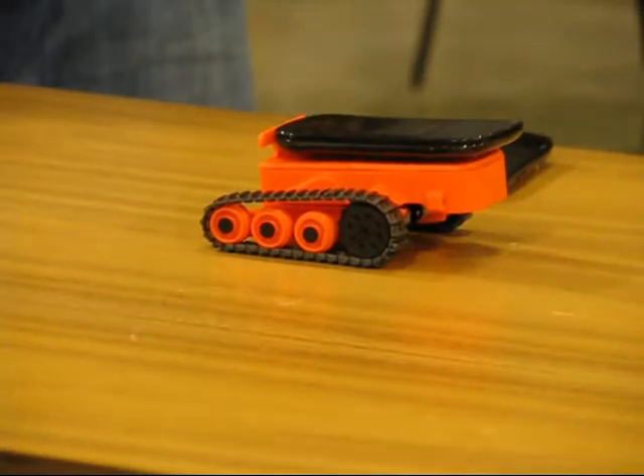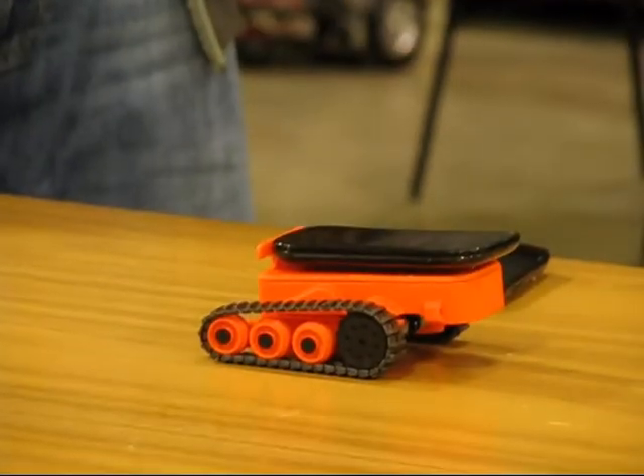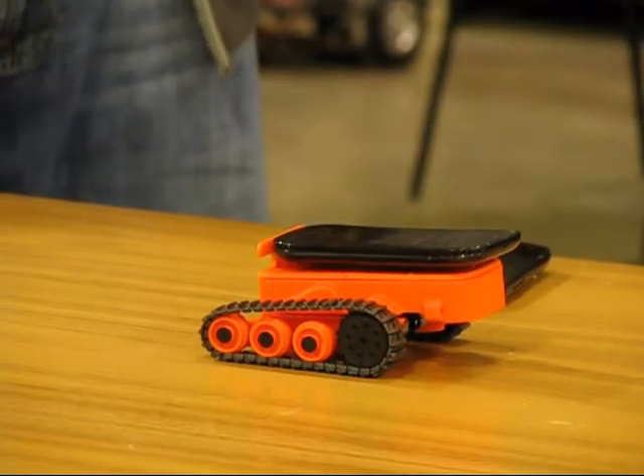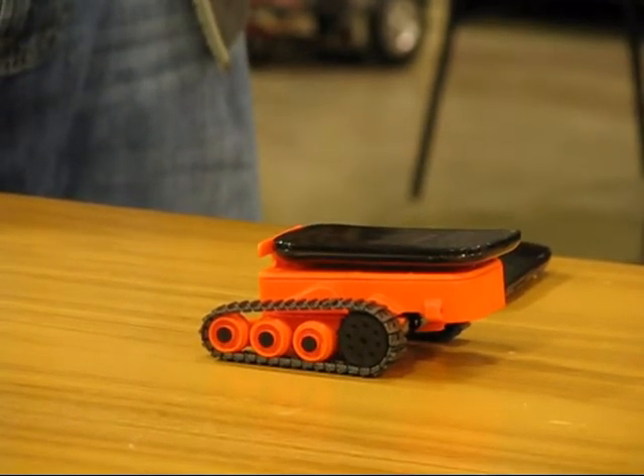You spend your money and it comes and you start printing. You don't have to assemble it like the original one — the original one was a kit. This one shows up in a box and you can conceivably start printing right away, although it doesn't really actually work out that way. You spend your first two or three days going through a list of tweaks you found online that you should make to it. Then eventually it comes to a point where you can get reasonable printouts. We tweaked it for about a month and arrived at a point where we can get plastic coming off of it that looks as good as other 3D printers, but for nothing.